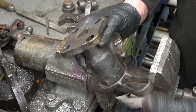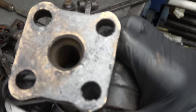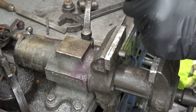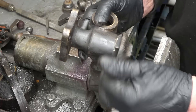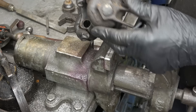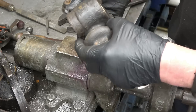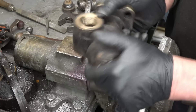Now, you did see that the valve wouldn't shut off. You can see in there there's a little plunger that screws down and is meant to seal off in there, so we'll screw that fully down — and it blows straight through it, which means the valve isn't touching the seat. I think it's hitting the handle before it gets all the way down. Next thing is to knock the handle off — the handles are pushed on and then hammered and peened across to retain them. It's a lovely bronze casting. That's the main defect: it's not shutting off.